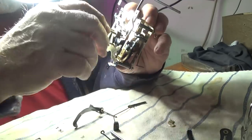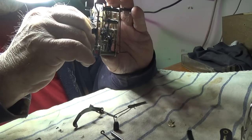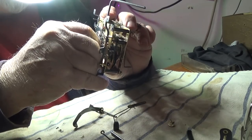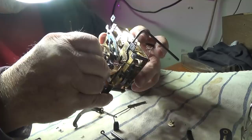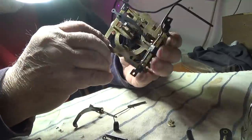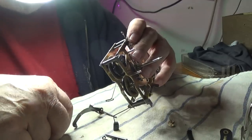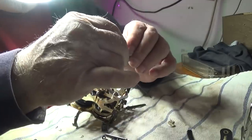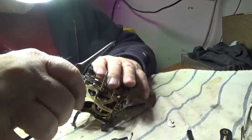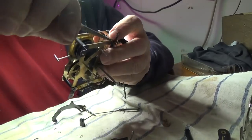So as that lever gets lifted, it gets in the way of that pin, and when that falls off, it continues to run. Okay, so that one goes on there, and that's held in with an E-clip on the inside, and I suppose we'll put that one on. Shouldn't make something small for an old man. Hard for me to see this garbage.